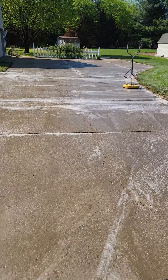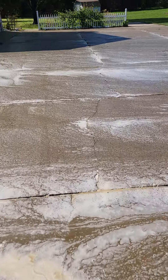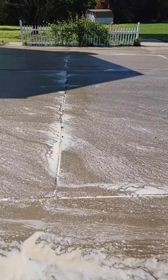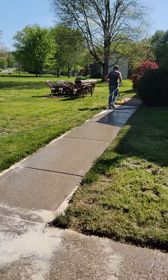Fortunately this house has really good water pressure, so that's been very helpful. Getting all this washed. We put our pre-treat down — we went pretty high on this, like a 4% sodium hypochlorite with a little bit of surfactant in there, just to give it a little bubbling action, and then we're surface cleaning away.